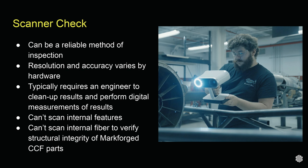There are many 3D scanners on the market that can provide highly accurate and mostly repeatable results. However, one thing 3D scanners can't do is scan the internal structures of a part — whether it's verifying that continuous fiber was placed correctly inside the part, or measuring the physical dimensions of internal structures that only additively manufactured parts can produce. Scanners also require a highly technical workforce to perform inspections, clean up results within the software, and compare them to the nominal part design file. Blacksmith automates all of this.